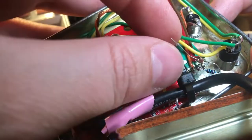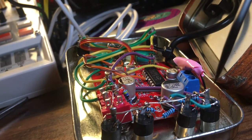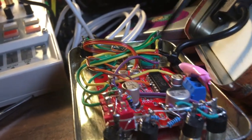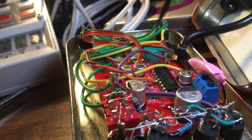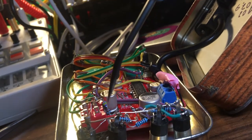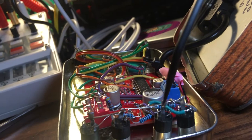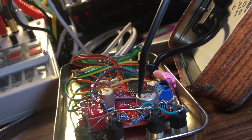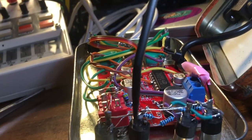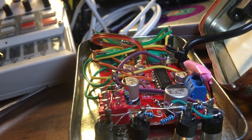This 10k resistor takes its place, which allows it to turn the repeats up so high that it feeds back on itself and goes willy-nilly. After using it for a few weeks I shorted this resistor, meaning the first jack connects directly to the input of this board and the two output jacks connect directly to the output. The next three jacks each have a resistor in line that lets them spread the love — three things can connect as a mixer without one of them overpowering the rest. There's a 1k resistor for each of those three jacks, and the first one is directly hooked in, so it's mixer action.